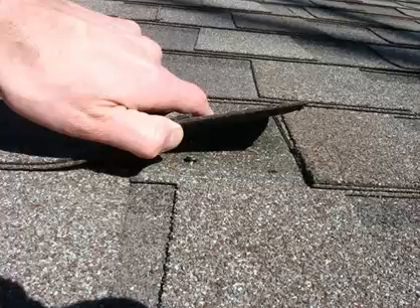Of all the different types of roof repair work we perform in Haymarket, Virginia, by far the biggest problem we see is improper fastening procedures of architectural roof shingles. Here you can see there's a roof nail exposed within the key where there's two shingles joined together.